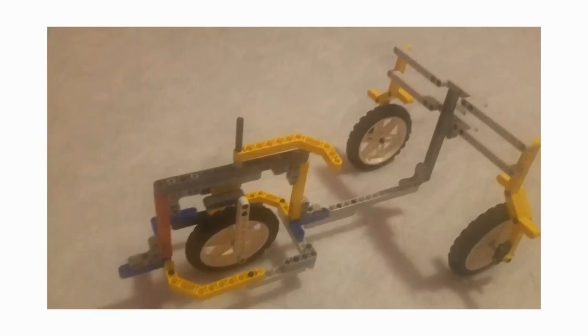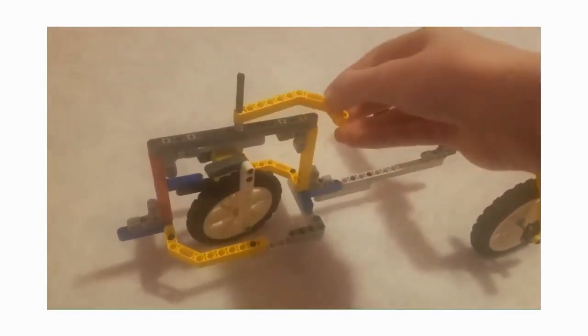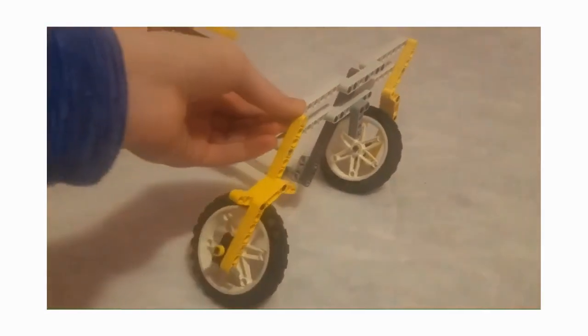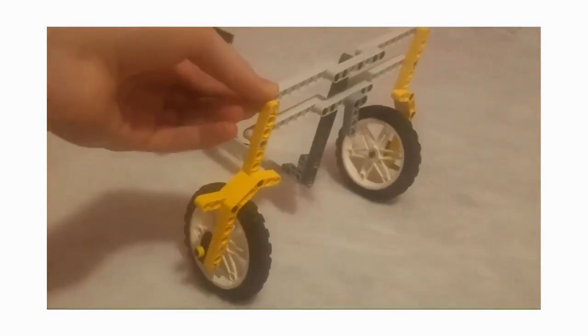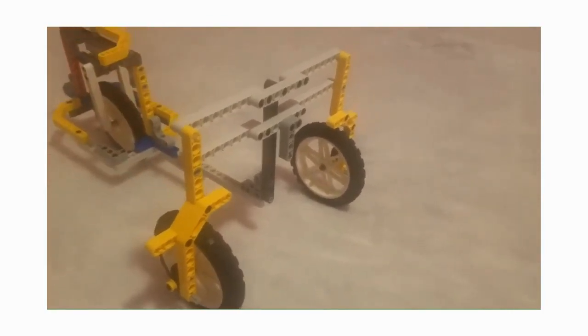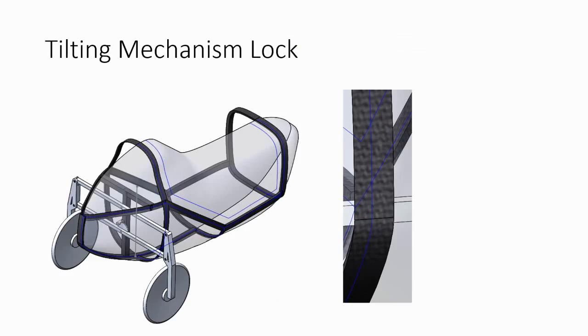As the tilting mechanism was not finished on Shrike, a simplified scale model was created to demonstrate its tilting ability. The lower horizontal bar also has a disc brake attached, used to lock the horizontal bars in place. By removing the tilting ability momentarily, riders can enter and exit the bike with ease. While useful, a trained rider should also be able to balance the bike upright on their own when stopped, such as at a stop sign.